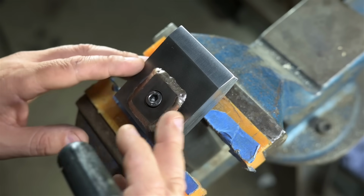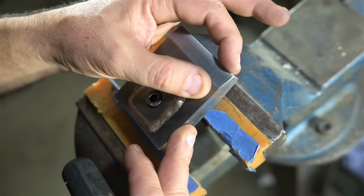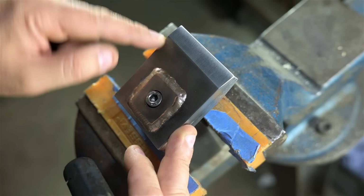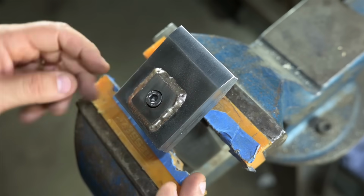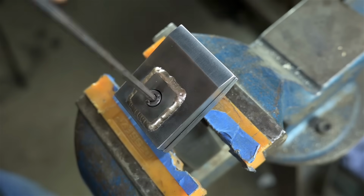And the welding caused a little bit of deformation, shifting of parts rather. I don't know if you can tell, like that chamfer tapers a little bit left to right, maybe a 1/16 of an inch thinner on this side. Not the end of the world. But some rounds would have been nice that now are almost impossible to put on. Anyway, let's give this a try.